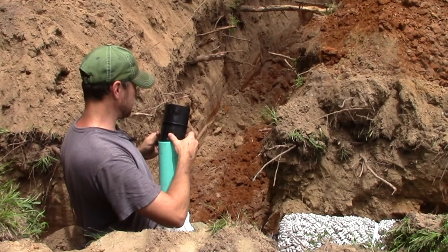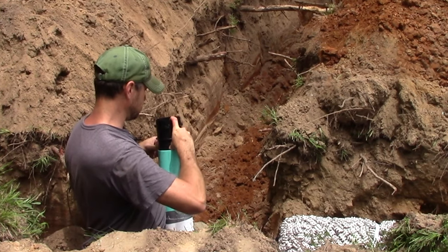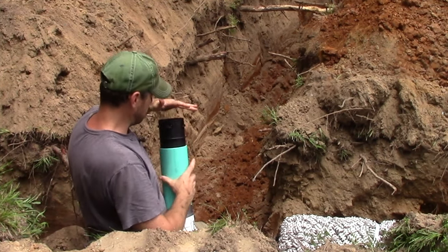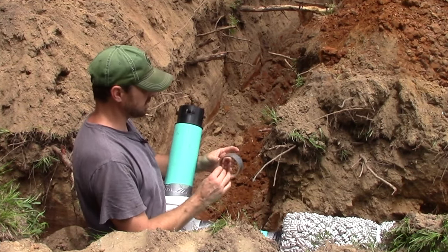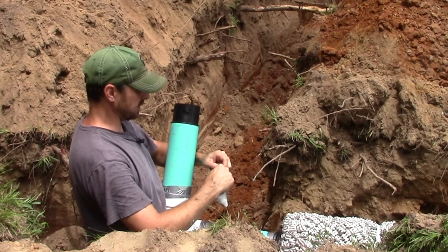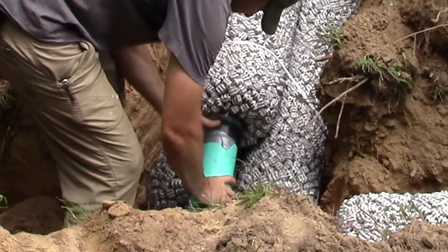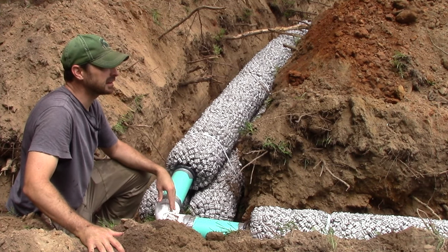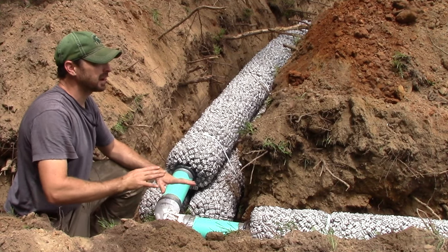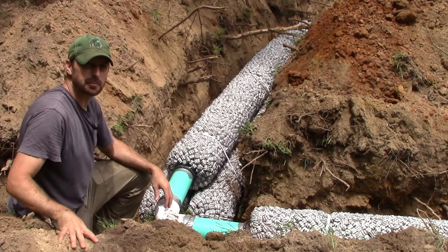We reached the end of our property — the portion that's flat and level — so we are taking this around 90 degrees here and running it flat and level in another direction so we can get our lineal footage. We're going to do some duct tape on this coupling in the end just to hold it while we backfill the trench, since there's no way to really glue this thing in here. It's incredibly important to keep everything flat and level so you don't create any ponding. That is extremely important for your septic system — you want everything to seep into the drain tiles and into the surrounding soil on a flat basis. You can have a little bit of slope but not too much.